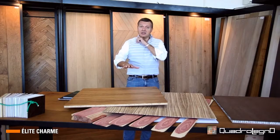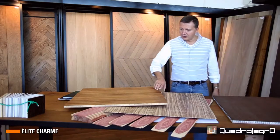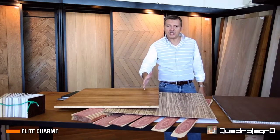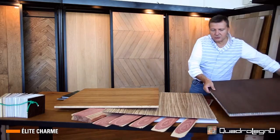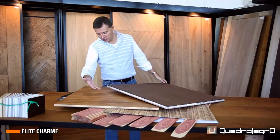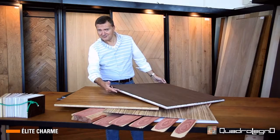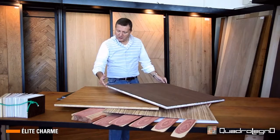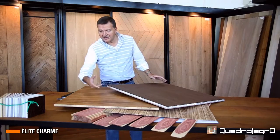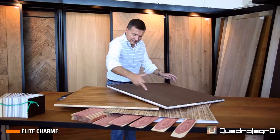It is also beveled with a very light lateral bevel and made for tongue and groove joint. Installation is only made by glue. The support can be varied depending on the situation — for example, if a lighter product is needed, aluminum honeycomb is used, such as in a nautical context. This panel has intentionally not been finished to show how the honeycomb support is made, because once finished, the border is filled with internal wood lats so the honeycomb is totally hidden.